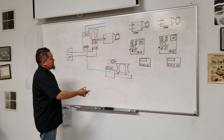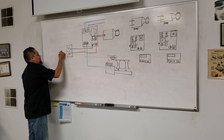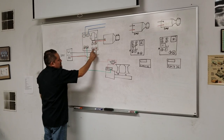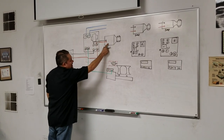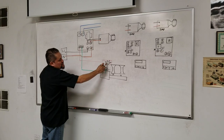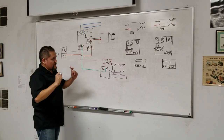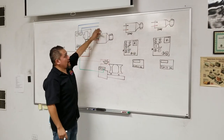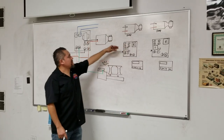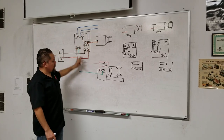It's pretty simple — almost the whole thing is already wired. We have the aquastat, 120 volts power right here, Line 1 and neutral going to the aquastat. We have C1 and C2 for the main building pump, B1 and B2 going to the gas valve, the rollout switch, and into the burners. We also have the T and T wires hanging here, waiting to connect this control to those two wires so whenever an apartment calls for heat it runs the burners and the pump.